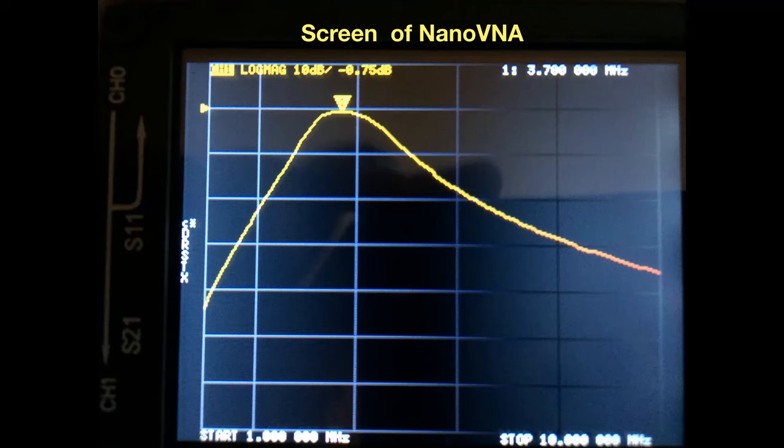Now, you could build a different design, something like a Chebyshev design. That has much steeper, sharper skirts, but you will get some ripple in the pass band. So it's horses for courses. There's no perfect thing. You have to decide what you want to live with: sharper skirts and more ripple, or not so much attenuation, but a smoother filter in the pass band.